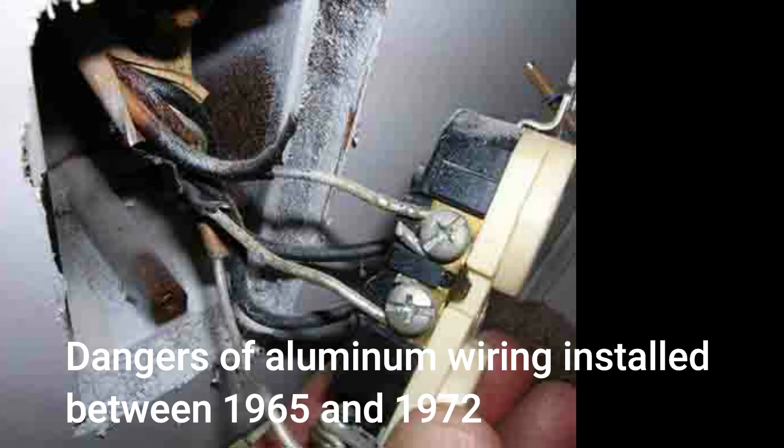You can see from the picture above that the wire has been hot probably several times. This was probably caused by two things. First, you can see the brass metal under the screw in the wire. Aluminum wire was meant to be used with compatible outlets made for use with aluminum wire. This is the most common problem associated with aluminum wire.